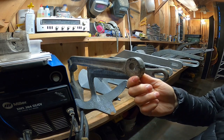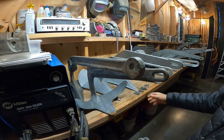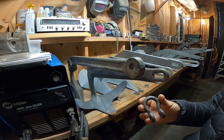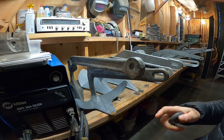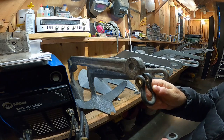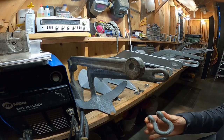This is the shank of a 45-pound genuine CQR anchor, and for this size range anchor, ideally you'd want to use a 7/16th shackle, which would work perfectly with 3/8-inch chain. You could use bigger or smaller chains and shackles in some situations, but that would be the most appropriate. Unfortunately, a 7/16th shackle will not pass — this shank is too wide — so that forces us to go to a half-inch.